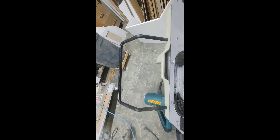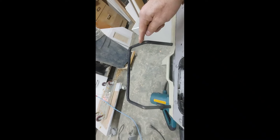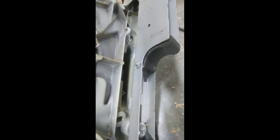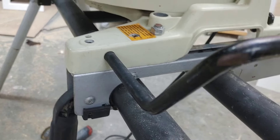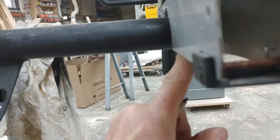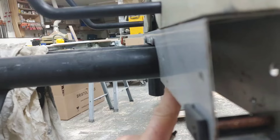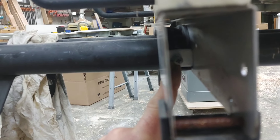Here's a little trick for anybody restoring one of these or who finds that their outfeed rigger is not parallel. Right down at the bottom here is a screw — a little grub screw — and you can use that to move this thing up or down. So if you need to adjust that, that's how you do it. When I put my locking handle down here, it doesn't pull this thing tight against those rails. So inside here is a screw that just needs to be pushed into position, and there's a lock nut behind it. I think most saws work something similar to this. If you're finding it's kind of sloppy on your machine, this is the kind of thing you need to do — look for stuff like this that can secure it to your stand.